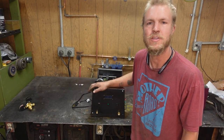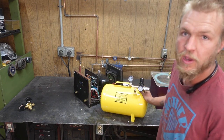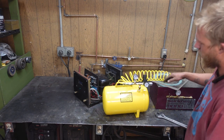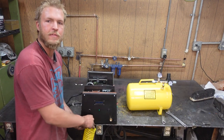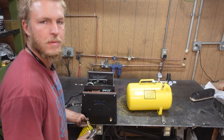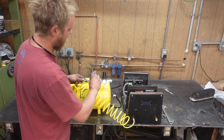This is going to be our first run on the machine. I put this little tank together with a regulator and a gauge to tell how much pressure is in here. The first thing we're going to do is suck as much air out of here as we can with the vacuum pump. Hopefully we don't mess up the gauges. I think we've gotten the majority of the air out of there. For our first run, I'm going to leave the case off just in case I did my math wrong on the volume — I'm targeting 50 PSI and I don't want to over-pressurize it. I do not want to blow up a tank today. I realize there's going to be a little bit of extra air in the lines that gets into the tank, but it'll be a very minimal amount. I think I can live with that tolerance.